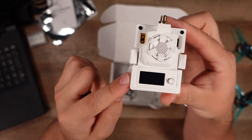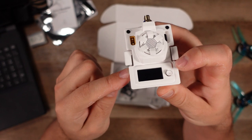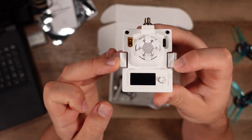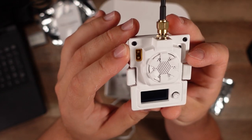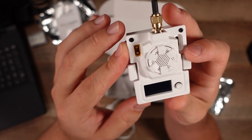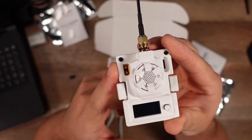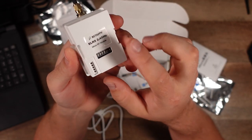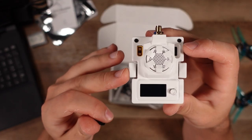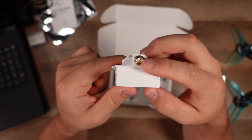The module has an OLED display and a 5D button for limited menu selection. You can do more in the LUA script and in the radio. There's an XT30 port as well as a USB-C port. The XT30 port is only for 2S batteries — if you have a Radiomaster battery for the TX16S, you could use the XT30 to help power this. You'll need that XT30 connection to run this at 500 mW or higher. You also have connection points for the radio, some dip switches, and the SMA connector on top.